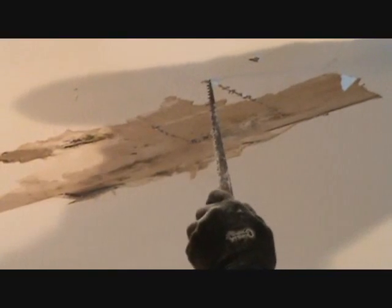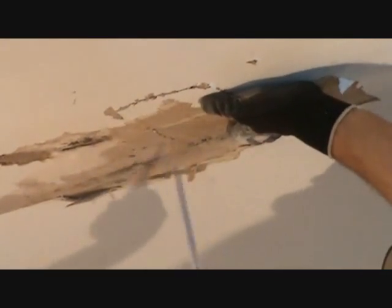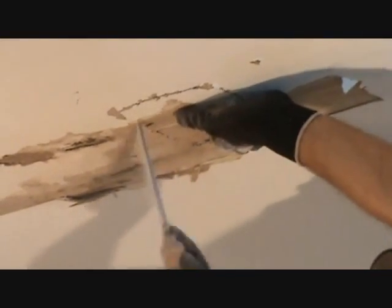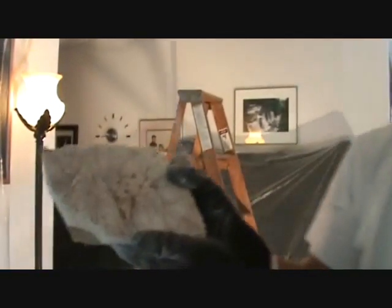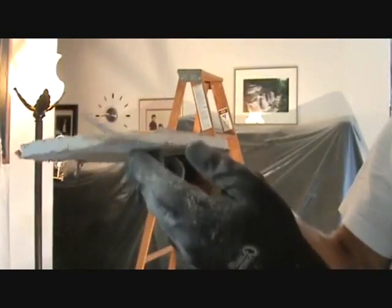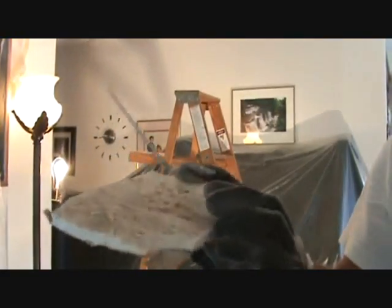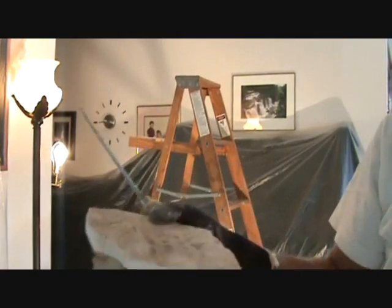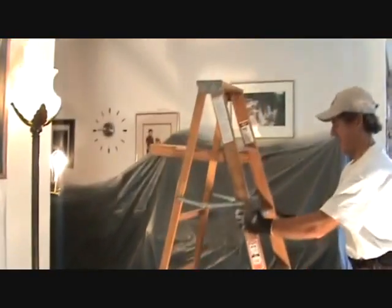This sheetrock feels really super brittle. The reason is because it got saturated all the way through and then dried out. Look at the back of the sheetrock facing up into the attic — this is supposed to have paper over it, but it's all been eaten away because it's been wet for so long. You lose the integrity and strength of your sheetrock when the paper comes off, and the only way that happens is if it gets wet for a prolonged period. That's another reason why you don't want to just go up there and patch the ceiling without removing this sheetrock.